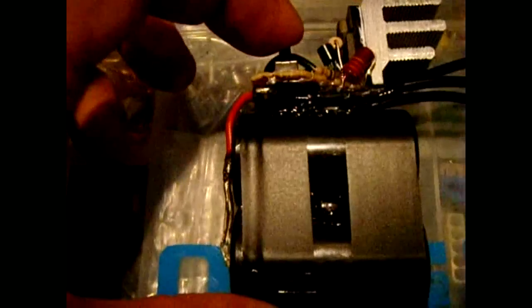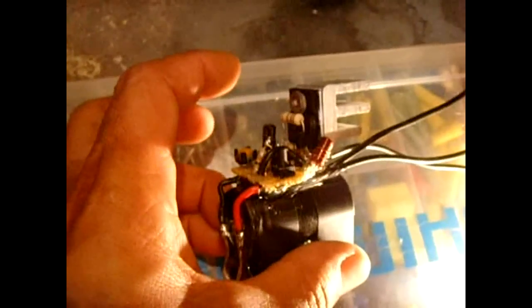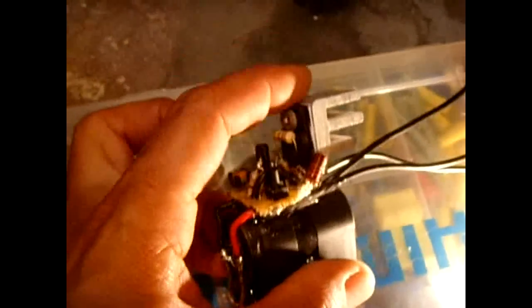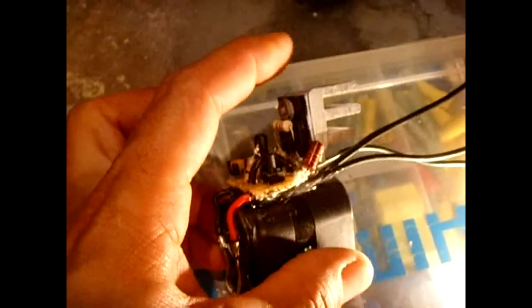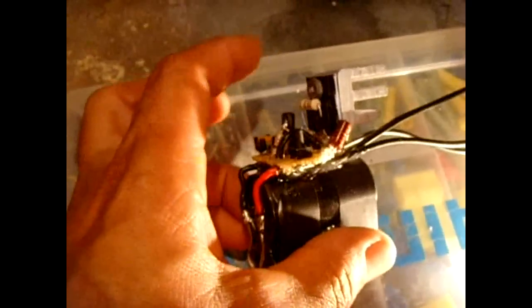Push this button — alright, that turns the circuit on. Just a simple 12-volt dome light. This draws only 1-point-something amps. The MOSFET is designed for 10 amps. And if you want to control something up to like 20, 30, or 40 amps, you would take the output from this MOSFET and run it into a heavy-duty relay or a contactor, and then you can do that.